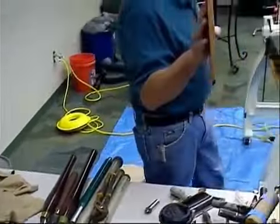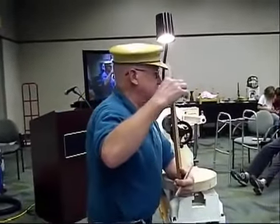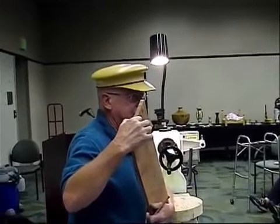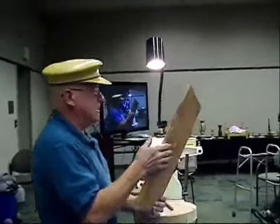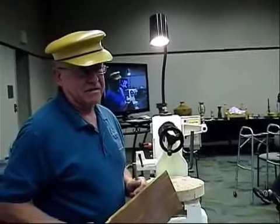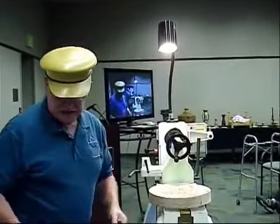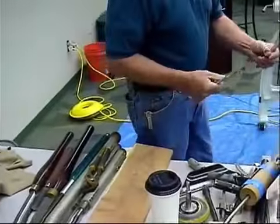Then you need a piece of cedar board. It has to be cedar. But put an angle on it. Go on the table saw and cut generally 15 degrees. That's what I normally do. Put the legs on the stool at 15 degrees, and I cut the bottoms of the legs at 15 degrees too. So this is my template. You can change it to whatever it is, but this is just a few things that you can use for stools.